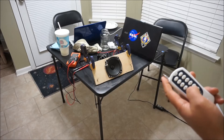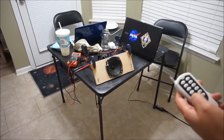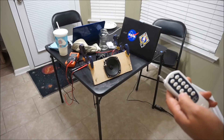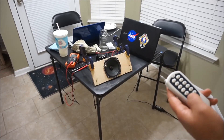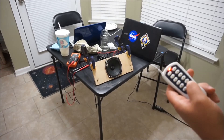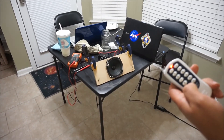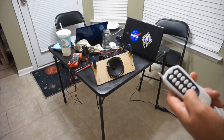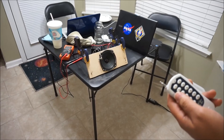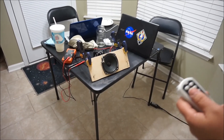Whenever you want to, there's a button that's been programmed to stop the music. The next time you start the music, it picks the next track in a playlist. The last two buttons were programmed to be volume down and volume up by 1 dB increments — you can turn it up or down remotely to adjust it to the event that R2 will be at. There are an additional four button pins that will be controlled analog from his driving motor, which we have yet to connect up.